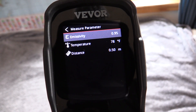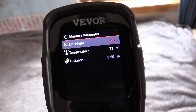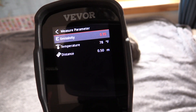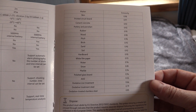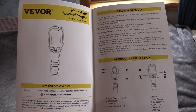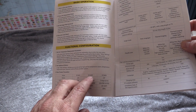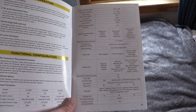As with some other cameras I've seen, we can change the emissivity setting — that's a correction scale for different materials. Things like glass, wood, metal, plants, or animals reflect or produce thermal radiation slightly differently. There's also a correction table in the manual. This manual looks pretty good — it's printed on decently thick cardstock and has all the specifications. We have the SC240M here, so we'd look at the middle column for this particular model's specs.